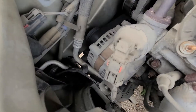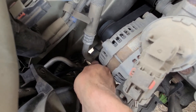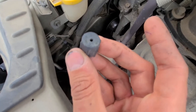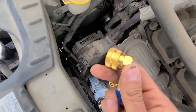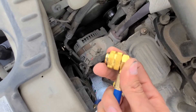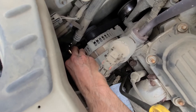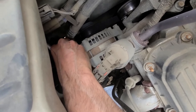The low pressure charging port is located right here under this black cap, so you can just remove the cap. It's always a black cap — this is how it looks. You will lift this sleeve and connect the connector to the low pressure charging port. It's a bit of a tight fit, but definitely doable, so it has to sit nicely.